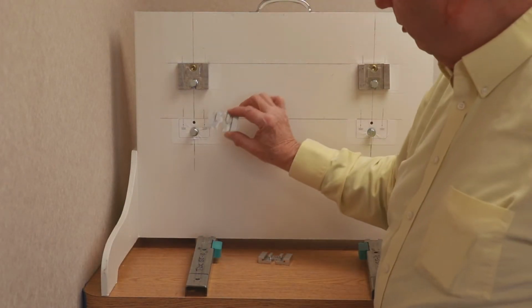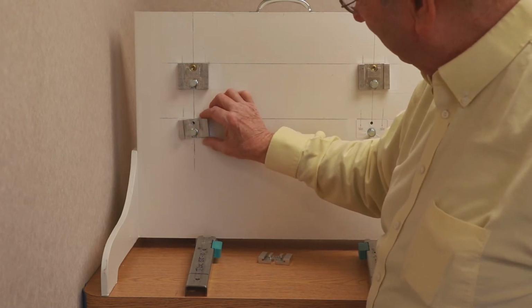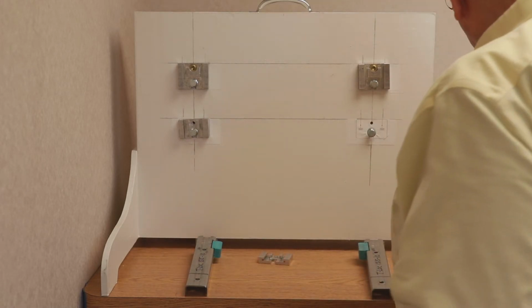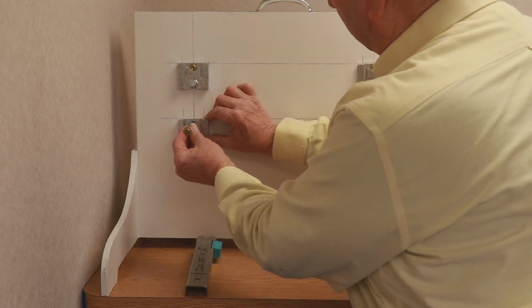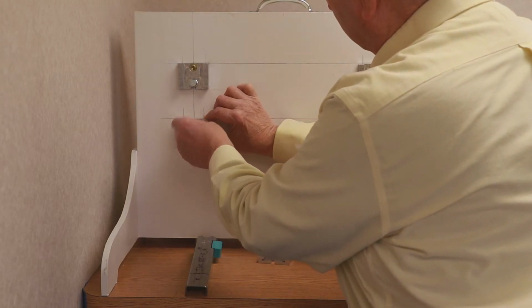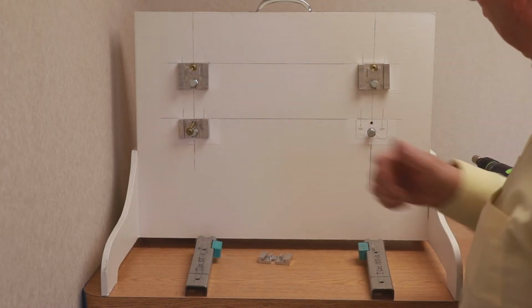Now the wall mounting plate for the T-Loc system slides right over the top of that saddle, and there she sits. Isn't that beautiful? Now when you go to put in your structural screw, it isn't such a fight to get this thing lined up. You're pre-drilled a little bit so you can get this screw started like this, and then sink that screw in there.